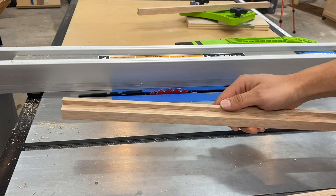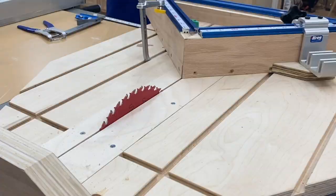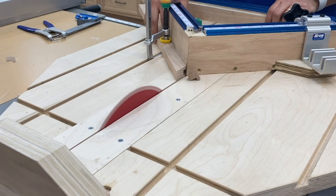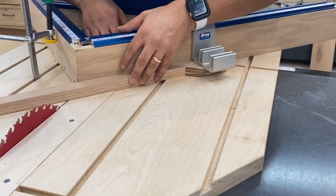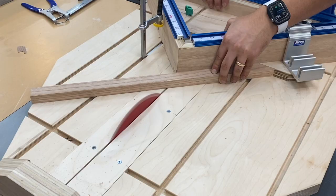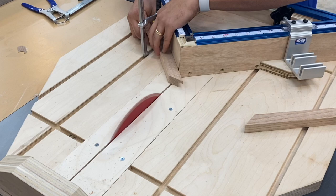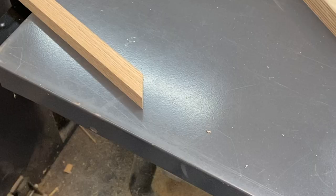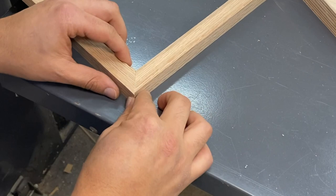Make sure you have plenty of extra pieces. The next step is to use either a crosscut sled with a miter attachment or some sort of miter sled. You can also do this on a miter saw, but it's a little more difficult to get these cuts to be repeatable. I made this attachment for my crosscut sled and it works perfect for applications like this. I'm not going to go into too much detail on measurements — I'm really just taking the old picture frame and using it to get these new cuts. In the future I'll be doing a video on how I made that attachment.